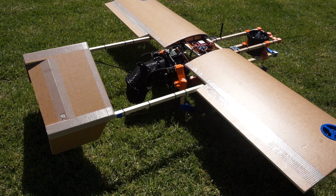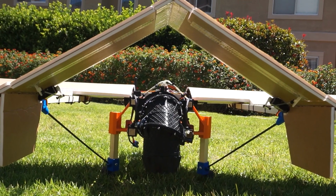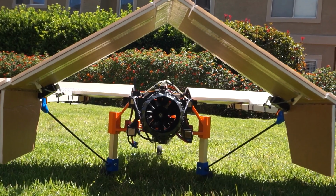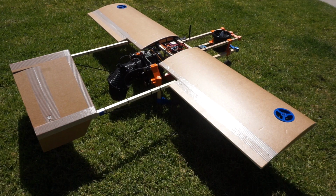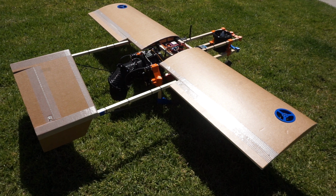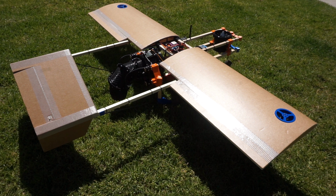It's got a simple straight wing with a simple NACA airfoil and an inverted V-tail supported by tail booms. There are wooden spars similar to those that make up the hover test frame that run across most of the length of the wing and also tie into the tail booms for extra support. The wing control surfaces are flaperons, just like on the F-35, so that I can use them to augment the approach speeds into the transition from fixed-wing flight to vertical flight.